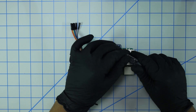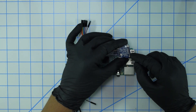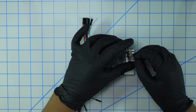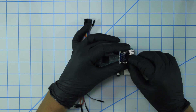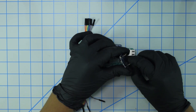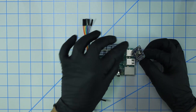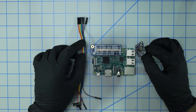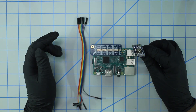There's one assumption I'm making: when you get the sensor from Adafruit, it doesn't have the headers pre-soldered, so you're going to have to do that yourself. Pro tip — definitely have the long side facing the rear of the breakout board, because you don't want your wires coming out in front and interfering with the sensor. It's a lot cleaner that way. With all that said, let's go ahead and wire this up.